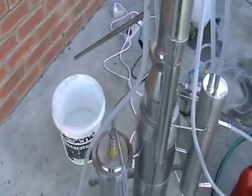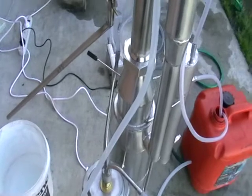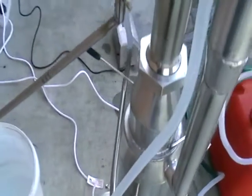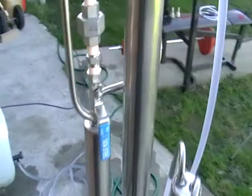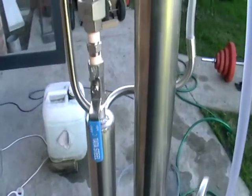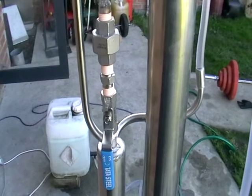Here's a water supply to cool the system. It goes from here and up into this condenser. Here you can see the reflux valve — reflux control valve — so you can control the reflux ratio and the percentage of ethanol coming out.